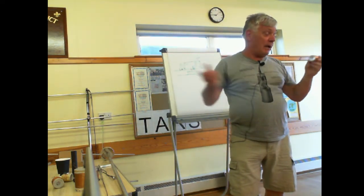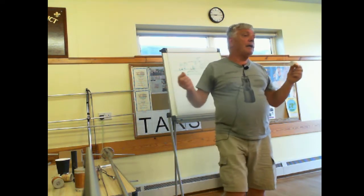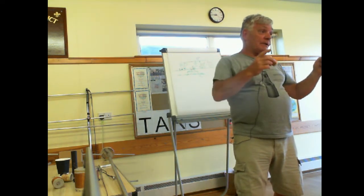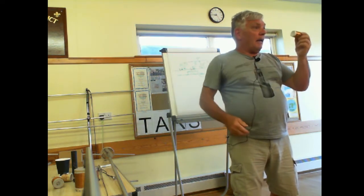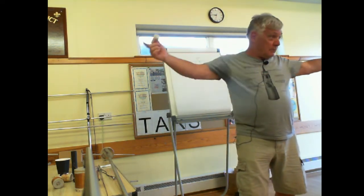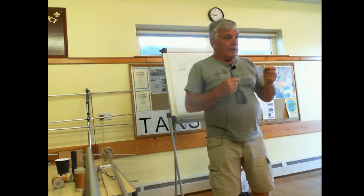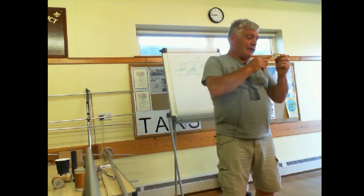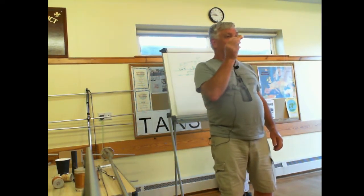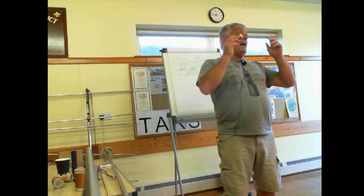And I've got two on my antenna at home, just like that. If you're making an antenna like a trap dipole, they're very easy to make. So you know what the dipole lengths have to be, and you know where the traps have to be, because if you want a trap at 40 metres, then it's got to be at the 40 metre point along the line, or 20 metres, you put one in at 20 metres and so on. I have one at 20, I have one at 40. Just remember that you've got wire here that isn't part of the trap at one of the other frequencies. So you have to calculate how long that is and take that off of your dipole length and so on, plus a bit more.